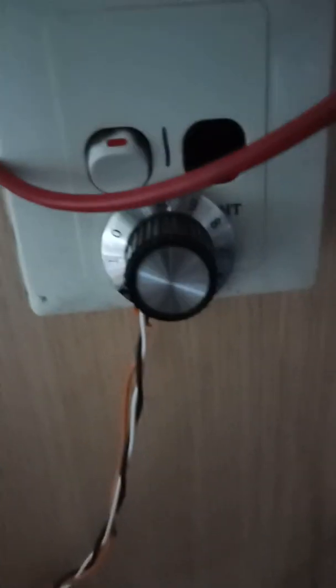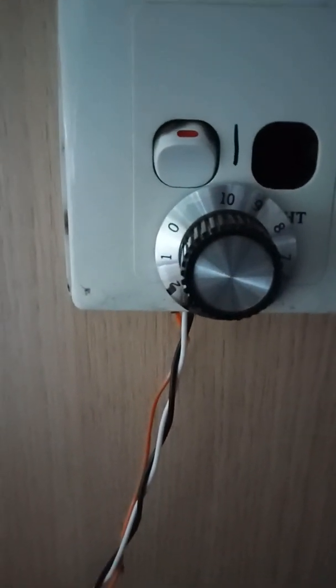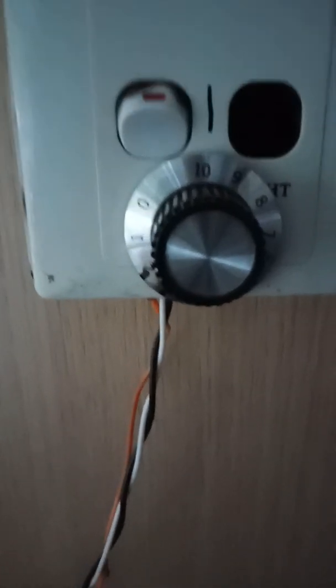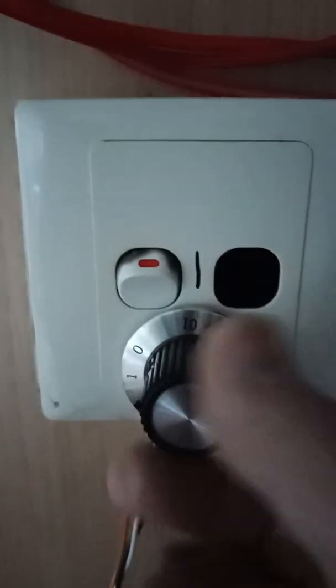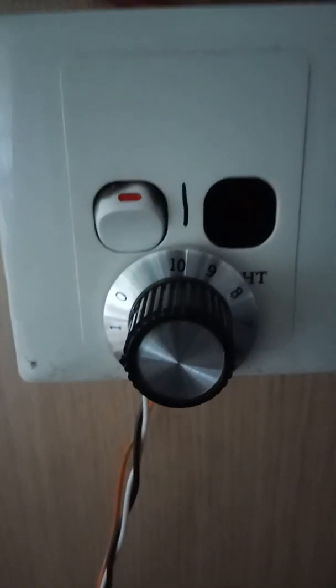This little circuit is what I've designed to apply the brakes when I adjust the voltage. I have that on the disc control over here. It's currently set for maximum, so as soon as it gets up near 40 volts it likes to put the brakes on. But you can turn it down and adjust it. This is on full brake at present, until I get the new braking resistors.